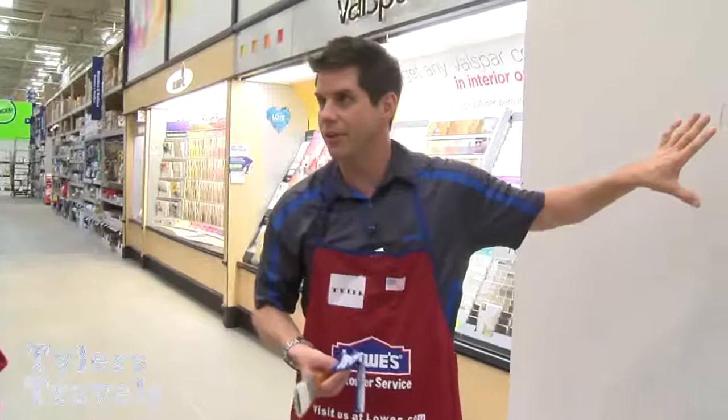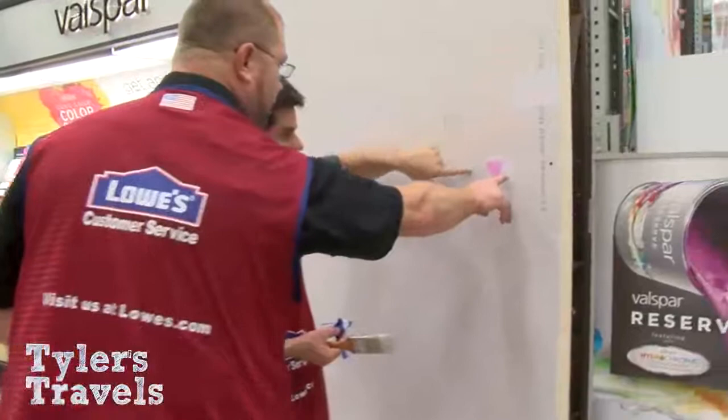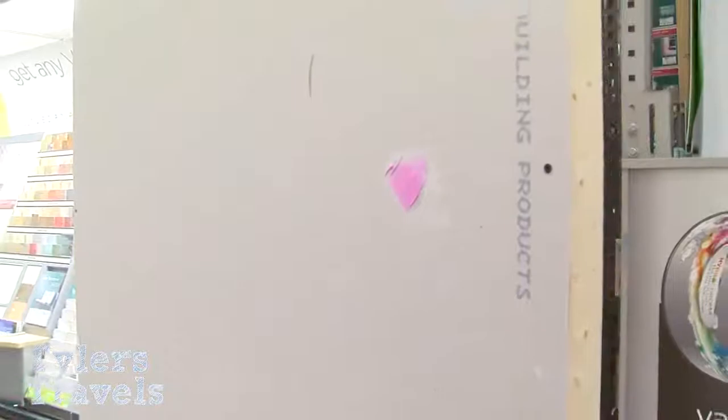It's not a multiple-day process — you can prime and be ready to paint within just a couple of hours. You can already see the spackle drying around the edges here. You look for it to turn completely white before you sand. We'll show you how to finish that off and then get to the actual painting and some cool techniques.